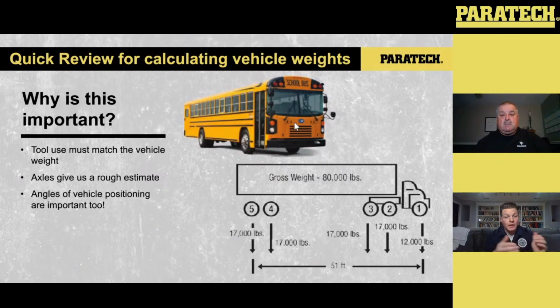So for example, if I'm dealing with a load that's 15 degrees off the ground, and we'll just say for an easy number, we're dealing with the tractor trailer on the bottom. So we're thinking 80,000 pounds. It's max loaded, just came off the lot, fully loaded. This bad boy's ready to make some deliveries. So if we take that tractor trailer and we're talking about a lift similar to the situation we had in the back with the back underride, with the vehicle that underrode underneath that car, because we're going to be pivoting that trailer to do that lift, I'm automatically going to cut it in half. Half the force is being exerted into the ground. The other half is going to be dealing with the lift. So from that point, if I have an object that's resting at 15 degrees, I'm dealing with 75% of that half.